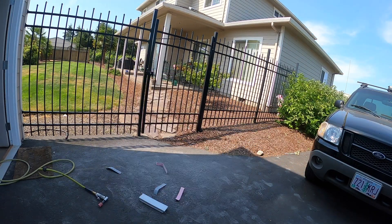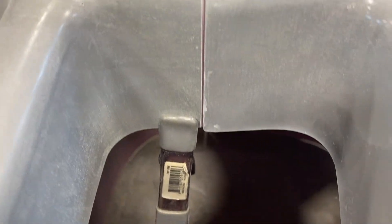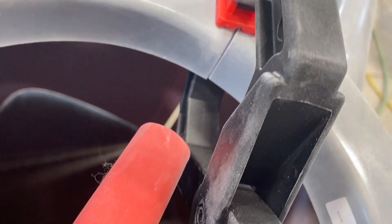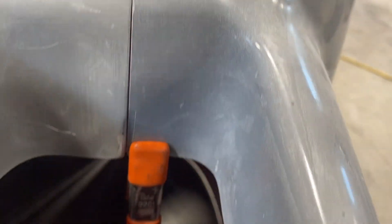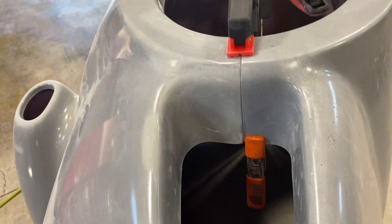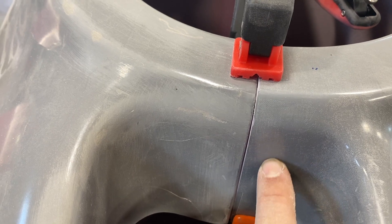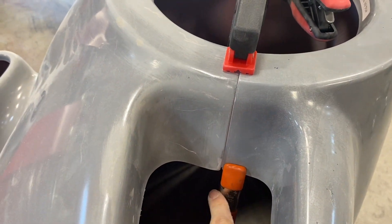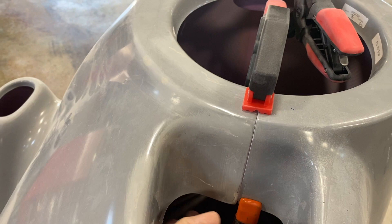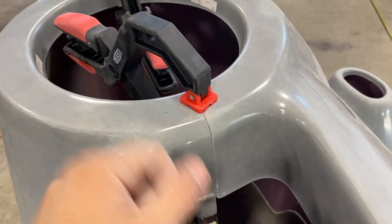About an hour and fifteen minutes later — now we have this. Looking at the other side, checking the gap, making sure it's nice and even and straight on both sides. Turned out pretty good so far. Now I have to drill a hole here, here, and here for screws that will hold the two front pieces together. The nut plates go on this side, screws through here into nut plates — three on each side.